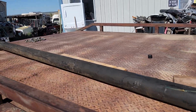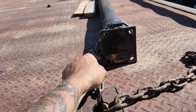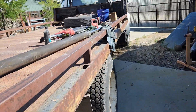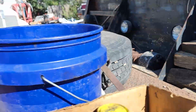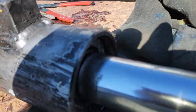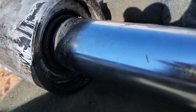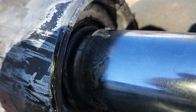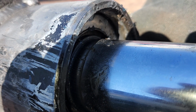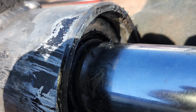Alright guys, we have re-rigged. Like I said, she jumped out from where I had her before, so we moved it a little bit. We still got to suck that chain up, or that slack. We just come down here, tied off to that. So, if you'll watch, you can see a kind of a dirty line right in there. And you should be able to watch this cylinder start pulling back in. Once it pulls till it gets the slack out of the chain and the void filled with grease, it won't start pushing on that gland again.